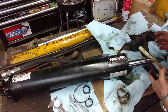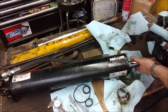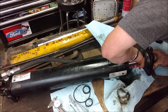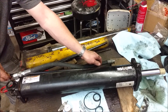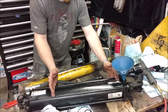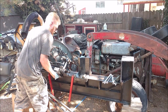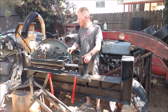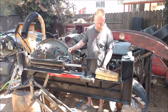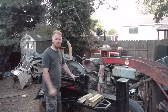It's all lubed up nicely. I've just got it tipped up with the rod all the way pushed in. That means the chamber in front of the piston is filled — if the rod was all the way out I'd be filling the back port. I'll just fill this all the way up with hydraulic fluid. After sitting all day — dry as a bone. Can't ask for anything more.